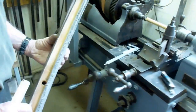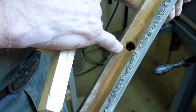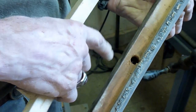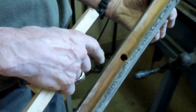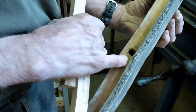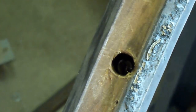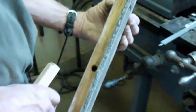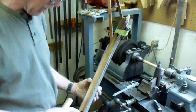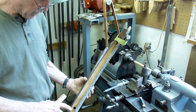The presenting problem is that we drill these holes in order to get the screws out. We used a hole saw — just a round saw with a set of teeth — and we cut around the steel screw and actually cut it out way down in there. There is a steel screw head still stuck in there, but we've effectively cut out around it and it's so loose now we'll be able to get it apart. But we want to fill these holes because we'll have to re-drill them in order to put them on the car — re-drill a screw hole and put a proper stainless screw in that won't rot away like the steel one.